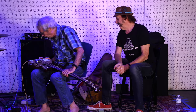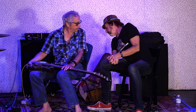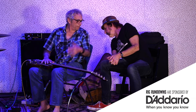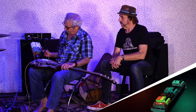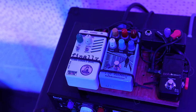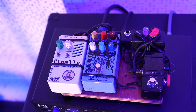This is something I think amps should always have: a high pass filter. Why put power in 20 hertz? It's a waste — it makes mud with kick drum, it's a waste of energy too. You want people to feel it. So this guy, this is Broughton — made in Canada. It's a little board unit. High pass filter, goes from 20. I usually put it at 40, but it depends on the room. Broughton, B-R-O-U-G-H-T-O-N. It's a guy in Canada. Broughton makes them.